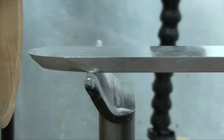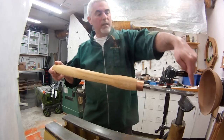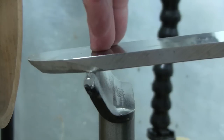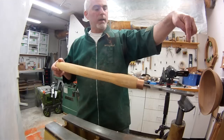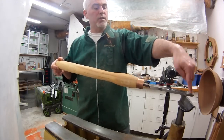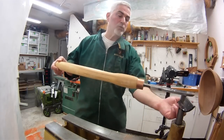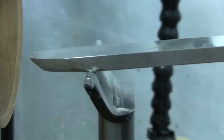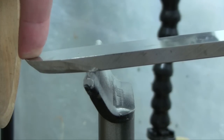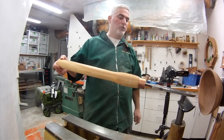What about conventional scrapers? Unlike cutting tools, with conventional scrapers we're always using them flat on the tool rest, which means we're always using a wide cutting angle - the angle formed by the direction of wood making contact with the cutting edge, in this case the burr, is close to perpendicular. Also with conventional scrapers we don't want to rub the bevel, so we hold them slightly downhill, which means any force absorbed by a conventional scraper is a 100% leverage force. So we need to use a higher ratio for conventional scrapers.